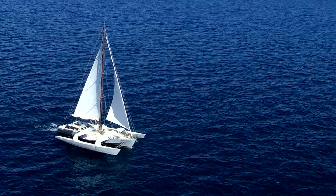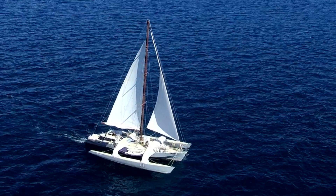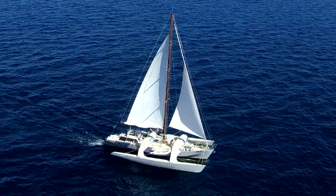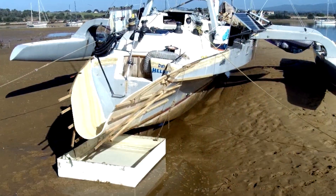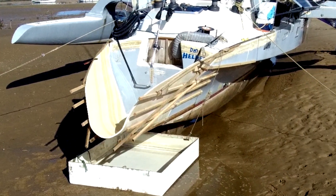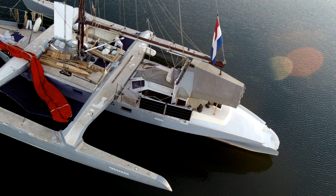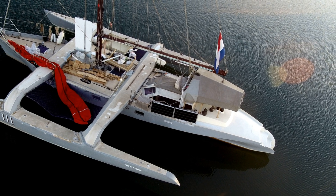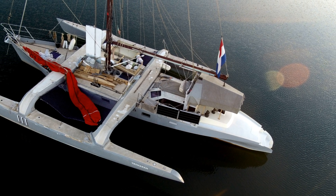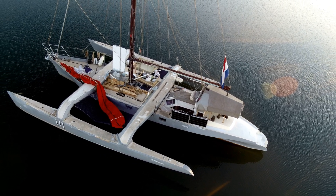We started this whole series by telling you that Tramer-on-Don deserved a new rudder because she was steering so heavy. We decided to extend the stern of Tramer-on-Don on the sandbank, because it was not just a rudder problem. She needed to be tipped backwards in the waterline — her stern needed to go down and her bow needed to come up. We are overwhelmed with the result, especially with all your likes and comments about it.